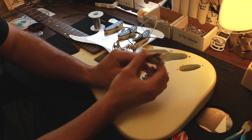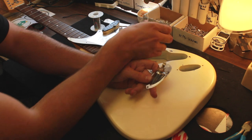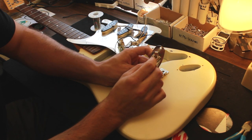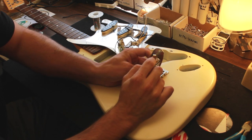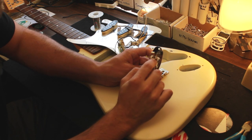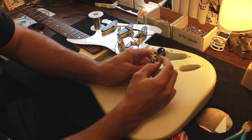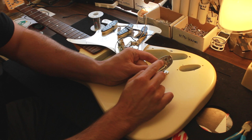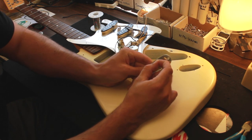The output jack — I've already installed it onto the jack plate. It comes with two terminals, one for white and one for black. The sleeve is this one right here, so that's going to be your ground. The easy way to identify it is that the metal wraps all the way around — that's the sleeve, which is ground, so that'll be black. And this terminal that's sandwiched in between the two layers of phenolic is going to be white — that's your hot.